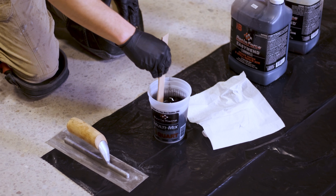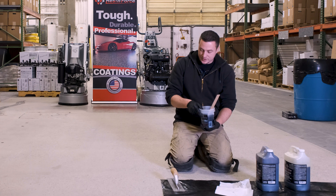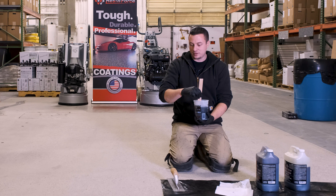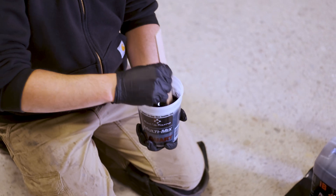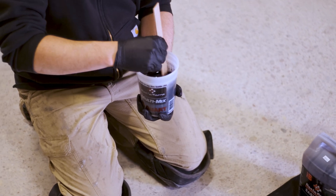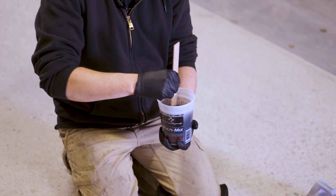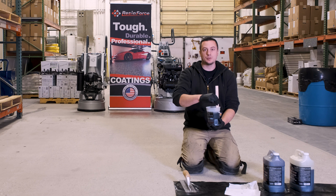The intention with the grout coat is to pull this really tight to the concrete using a clean trowel, going in both sweeping directions back and forth to get the entire floor. The purpose is primarily to fill the pinholes of the concrete — to seal those up to minimize outgassing, and also to fill pinholes for polishing to maintain that high gloss look when we're done. There are a lot of different products on the market you could do this with, some low viscosity, some high viscosity, some with a horrible odor and some with no odor, but the process is the same. These products typically have a very quick cure time, but when you're grout coating a floor you don't really need a lot of working time because you're moving across pretty quick.